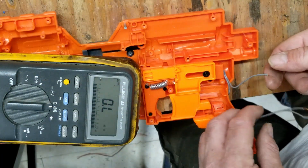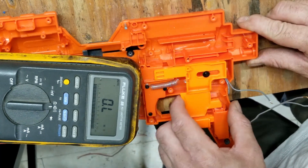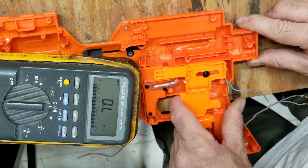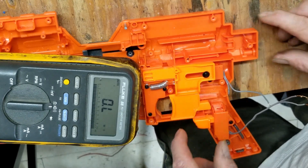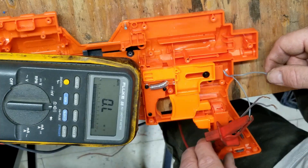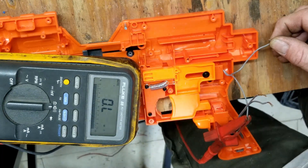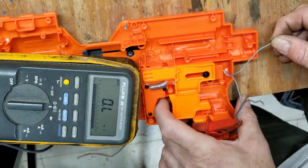One of the things I was looking at with the trigger — it's got a lot of travel. It was a Nerf gun. I've reused the micro switch that's there, so it does have a micro switch, it's not a crappy switch, but there's a lot of trigger travel. I put a spring on it so it comes back. I want to measure the resistance on the switch and find out how much travel I need to get continuity. I can see a wear mark about halfway between that knob and where it is now.